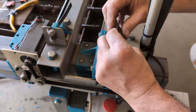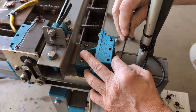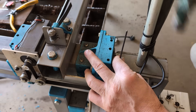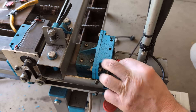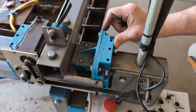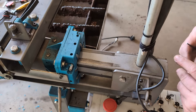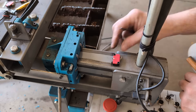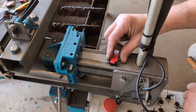Center punch. Move it back up tight, remove the transfer punch, and go ahead and punch the second hole. Should have two center-punched holes — one there, one there. Move this out of the way and we'll drill and tap for this micro switch. If you notice, when we put the terminals on the inside, we're going to run the wires over here to keep them out of the way.